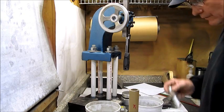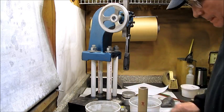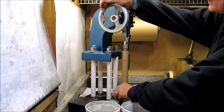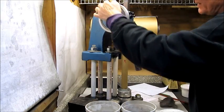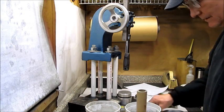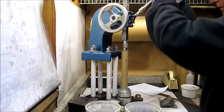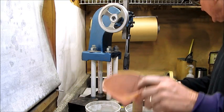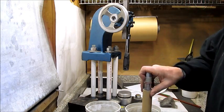I have a top-of-delay line marked on the solid rammer. I'm going to use the same size propellant scoop and press Win 39J delay composition in there until I get to my top-of-delay composition line. I'm keeping my eye on the do-not-pass line to make sure I'm not getting too close while pressing that first increment of delay. It looks like I probably need one more increment of delay — I'm using three-quarters of delay drilled back to five-eighths in these motors for the kind of delay I like.